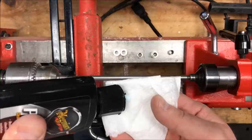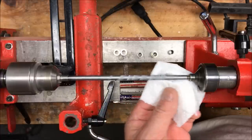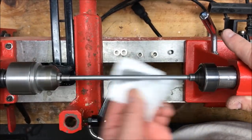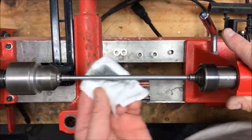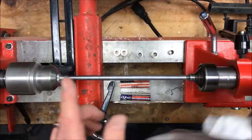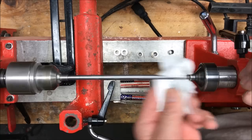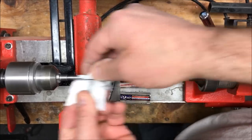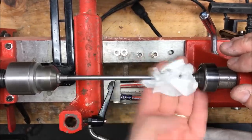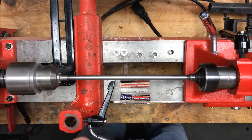Now what I want to do is put just a little bit of Plastics polish on here. This is a polish and it's going to polish it up and make it slippery. Hopefully it'll put a surface on there which will help reduce the possibility of the CA glue sticking, because the CA glue can run down the non-stick bushings sometimes and get onto the mandrel. Or if you're CA-ing with bushings it can get between the bushing and the blank. So I'm just going to polish this up a little bit in hopes that it'll help. You could also use a little paste wax on here — that would help. I'm looking at my mandrel and I'm really happy — it looks like it's running fairly true. I think we're ready now to go ahead and get these blanks chucked up.